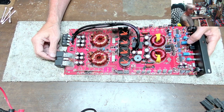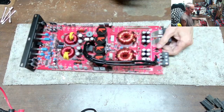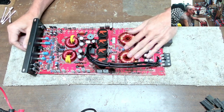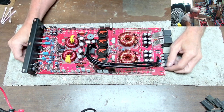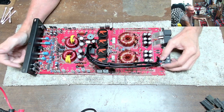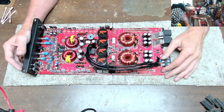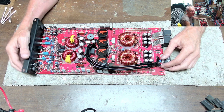I'm going to rebuild this power supply. These are really simple amps to rebuild — cut out the shorts, rebuild your power supply, get it up and running, then pulse it to make sure you have rail voltage building. Check for heat and make sure you don't have any thermal issues in the power supply, then rebuild your output section. That's where I'm going to leave this. I'll stop this video here, do my work, review the function of the power supply and go over the thermal characteristics in the next video. This is part one to help keep the length manageable.